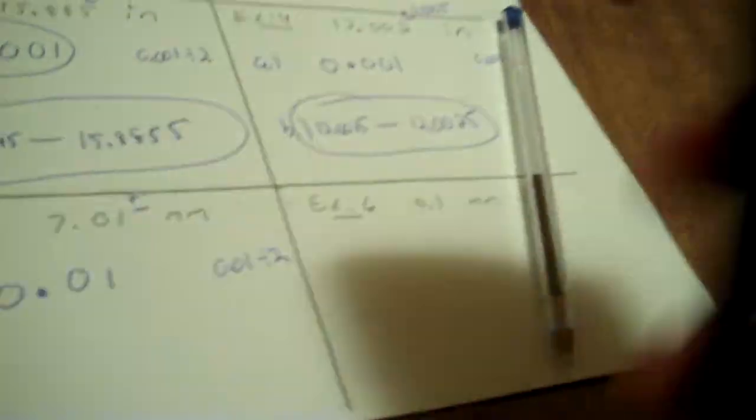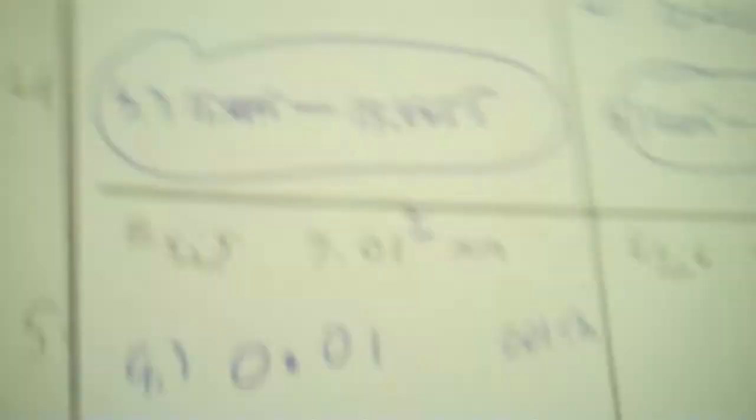Even if it's a one there, you still put a one and everything before it goes to zeros. So you take your 0.01 divided by 2 and add or subtract that amount — five thousandths, which is 0.005. Take 7.01 minus 0.005, which gives 7.005. Then click up and add: 7.015 is your maximum.